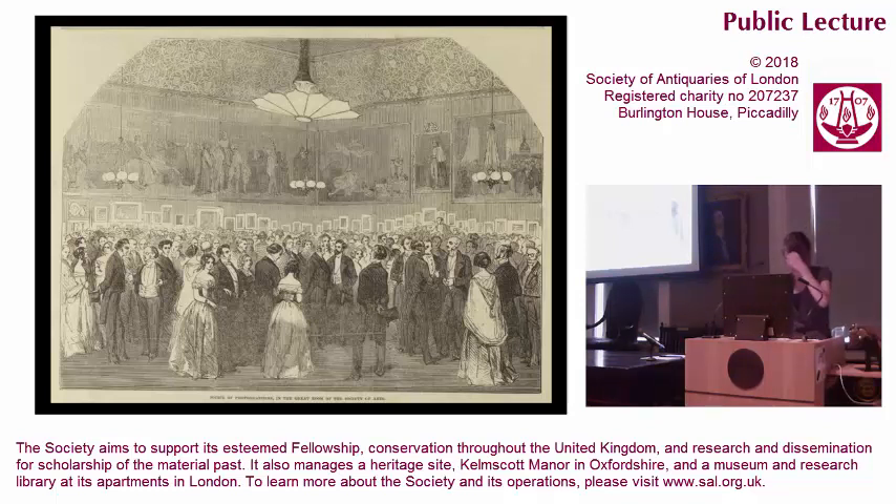Marine engineer Francis Herbert Wenham had just set out his paper on constructing glass balance springs for timekeepers — a method he had developed in the late 1840s, where window glass, heated by a blowpipe and drawn into a thread, was wound onto a conical mandrel to form a spring, then dropped onto a hot iron bar. On contact, the conical spring would collapse into a flat spiral.